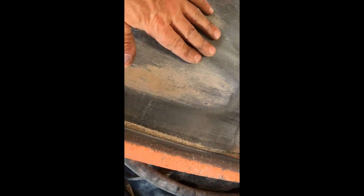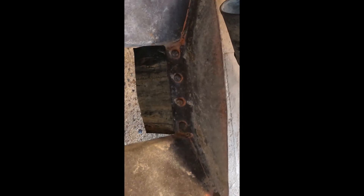I want to show this running board — it sits on top of the metal conveyor and you'll see it's quite badly worn, gone through to the metal there. Ideally I need to fit a new one before putting the conveyor on, but unfortunately I haven't got any in stock — I'll have to buy a sheet and cut it to suit. This roller is quite badly twisted, which is nothing more than the adjustment being out on one side, so I'm going to adjust that now to get the conveyor roller where it should be. I've put the new rubber shroud on — it's just a bit of an old conveyor belt cut up to fit — and then I can get the conveyor belt back together.